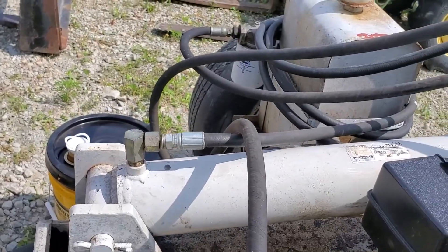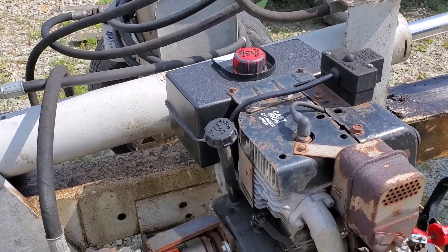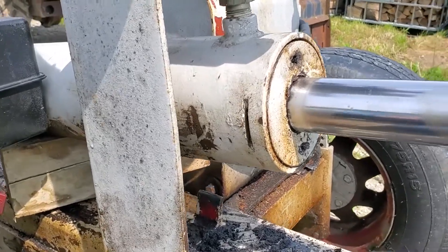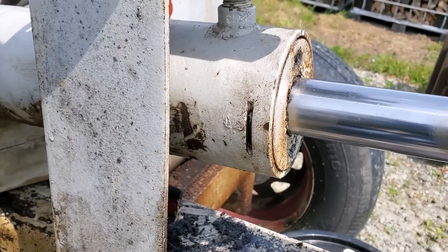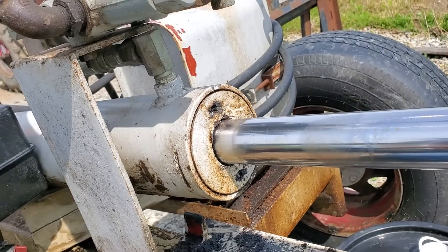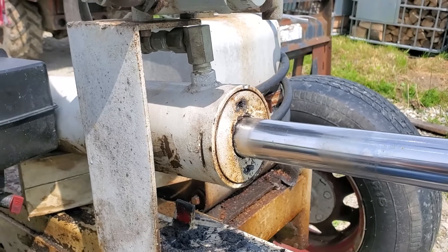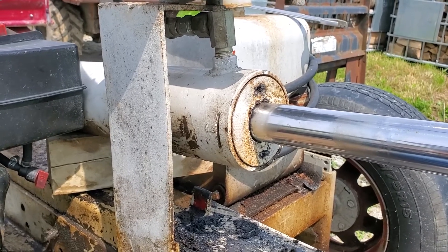I think I'm going to trace this hose around, stick it in a bucket, and purge the cylinder of any hydraulic oil that's in it. Apparently the end cap is held in by some kind of retaining wire or clip — I'm not exactly sure of the nomenclature. Those spanner notches are only made to turn the cap; it's not a threaded cap, it's held in with a clip. I'm going to figure out how to get that out — I may record it on my phone and splice in the video. It's going to be a learning experience.